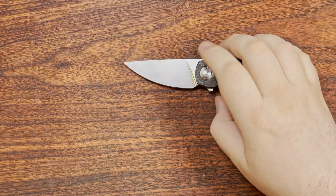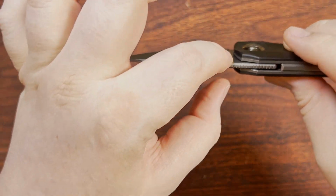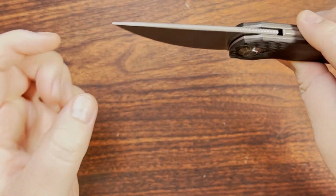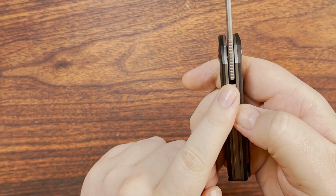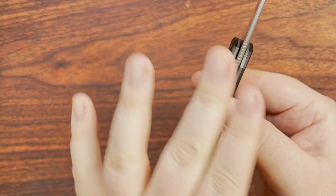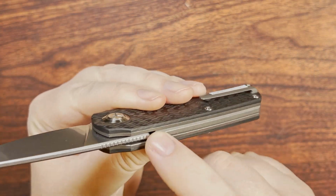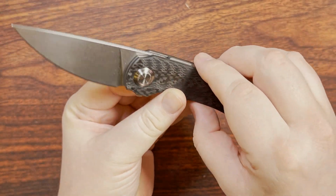We got 3.75 millimeter blade stock thickness on there. And we have just a little tiny bit of, I wouldn't call that a swedge, but just kind of a knocking down of the top spine there. Not really a crown spine, so to speak, as it's two very individual facets, but it does kind of match quite a bit with the back spacer that's fully featured here.